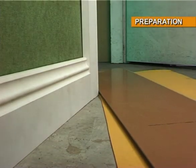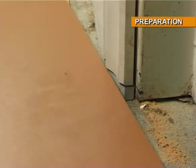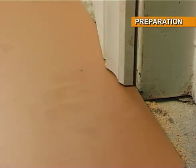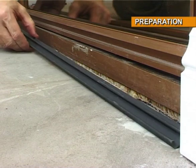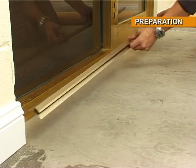Where possible, undercut all door jambs and architraves to allow the floor to slide freely underneath. Use a scrap piece of board and underlay as a guide. Fit the Quickstep base profiles, and where necessary, any other trims at this time.